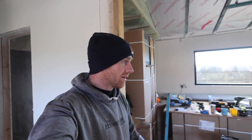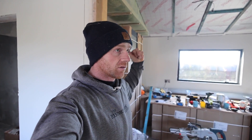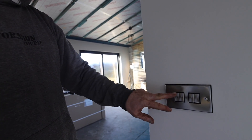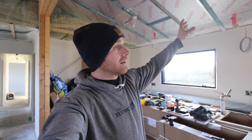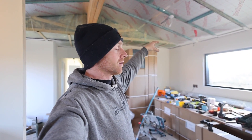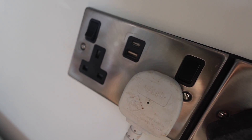Fans have all got to go in still, so I say it's done but it's not done. We've got a day in January to pencil in for getting all the final stuff done — outdoor lights, appliances and fans and the MVHR units. This is for the main living room — so we've got lounge, dining room, kitchen and the island. We're going to hold off wiring the pendants above the breakfast bar simply because it makes sense to get the ceiling in and then beams in and then hang them off there. We haven't yet decided on a kitchen light — it will probably need to be a bar with some spots just to light the whole area. So I'll just put a plastic pendant on there for now. We've got double sockets everywhere, and the USB one's quite nice — they have the normal USB but also USB-C, which is pretty cool. We've done a few of those, maybe six.